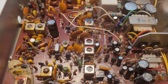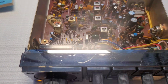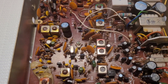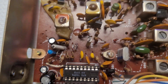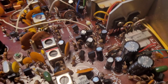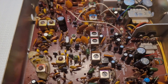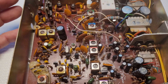When I opened this up, I was kind of shocked to see that this wasn't a Cybernet or Uniden board. This is actually a Pathcom board, which is Pace's parent company. The PLL comes socketed, and there are some really good parts in this radio. The relay is Matsushita — aka Panasonic — and even the capacitors are Nippon Chemicon, which are really, really good capacitors. This is a well-made radio, I can tell you that.